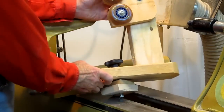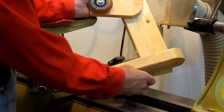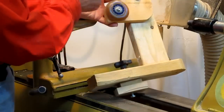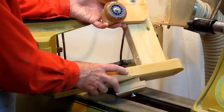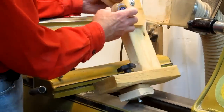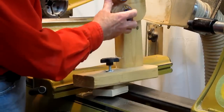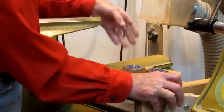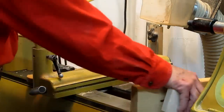Here's a simple spindle steady rest I made for large spindles — nothing real fancy. It's two-by-four construction with a clamp block that goes between the bedways. Basically a couple of old skateboard wheels with a carriage bolt between them with a notch that'll accommodate different sized spindles, and it'll adjust just a little bit to accommodate minor differences in measurement when I set it up. I don't do a lot of big spindles, but it's handy if I'm doing something where it might tend to cause a little chatter or vibration.